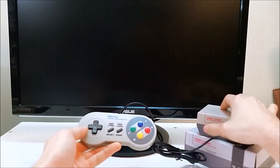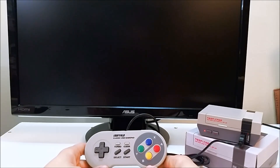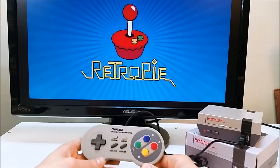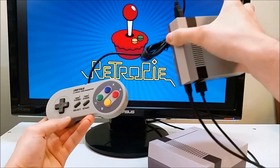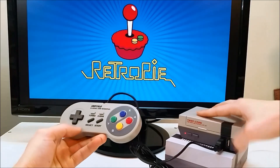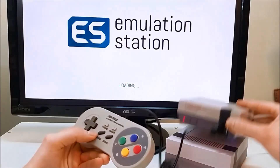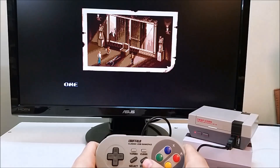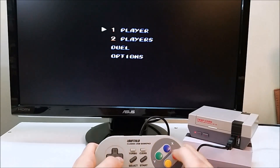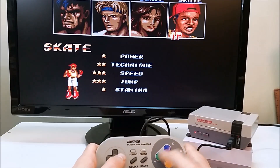The front has a working power switch with an illuminated red LED light, and the reset switch also works, but these are not software switches — they're not triggering a script or a GPIO. They're just interrupting the five-volt rail. So if you reset or power off before doing a software shutdown, you're likely to corrupt the SD card if it was in the middle of a write instruction. Other than that, it's a really well-thought-out case if you can get it at the listed price off Alibaba.